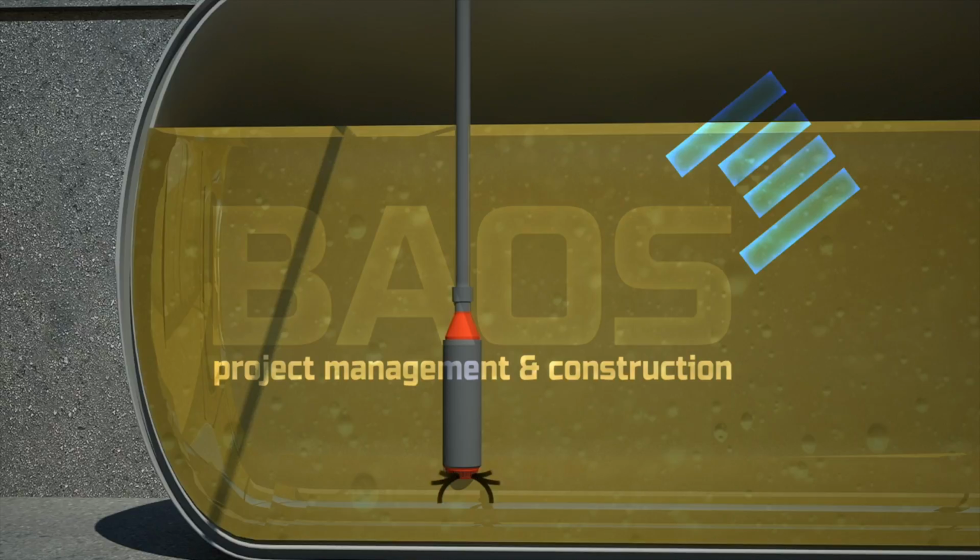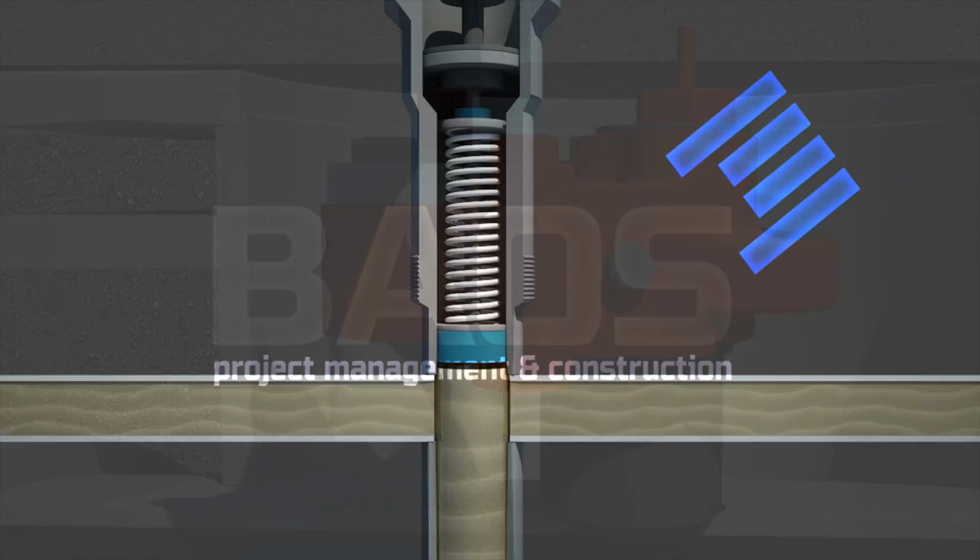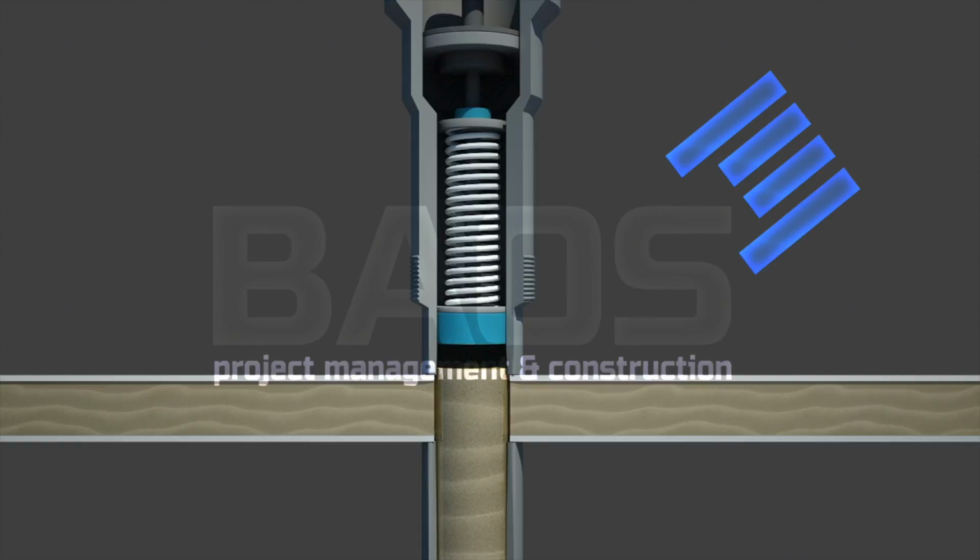Mechanical line leak detector is another essential part of the safety story. MLLD is a pressure-operated valve designed to detect leaks of 11 or more liters per hour. MLLDs perform a test of the piping each time the pump is turned on. In the event of a failed leak test, MLLD is capable of reducing the flow of product to the dispenser and, along with an electronic relay, shutting down the pump when the MLLD detects a potential leak.